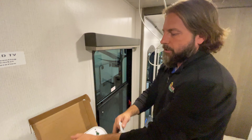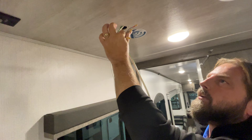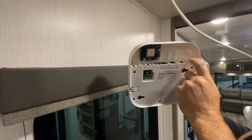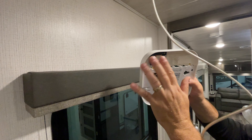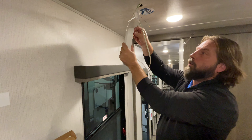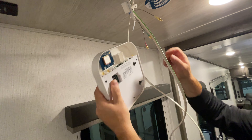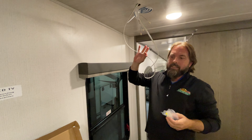The next thing people don't understand is where these three different wires go. You can see they're color-coded: red, green, and yellow. However, they are not color-coded on the gateway where they hook up. You have to look in your instructions — it'll tell you, I believe number 2 is red, number 4 is probably yellow, and number 5 is green. Check the instruction manual to confirm. All they do is just push in and click into place, so make sure you get those clicked in securely.